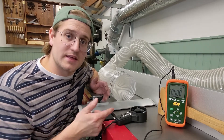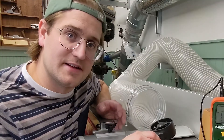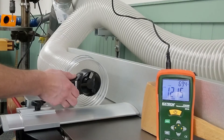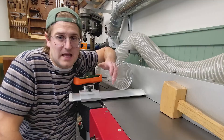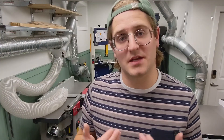Time to compare this ducted system to what I had previously — just the flex hose. With my fan curve and the info from step 4, we calculated that we should have 1,250 CFM here at the jointer. Sadly that's a little less than what I had before, and once again it was pretty close to what we actually calculated. Now that I've shown you how to properly design your dust collection system, let's be real — you don't need a fully ducted system for better performance in a small hobby workshop like mine. Moving a flex hose from tool to tool, while inconvenient, won't actually reduce the performance at this scale. Hopefully you can use this video to size your pipe, flex hose, or even your dust collector. Lastly, everything you've learned will go to waste unless you take care of the air quality in your shop — click on the screen now to see a way better solution than those cancer-causing filter boxes.